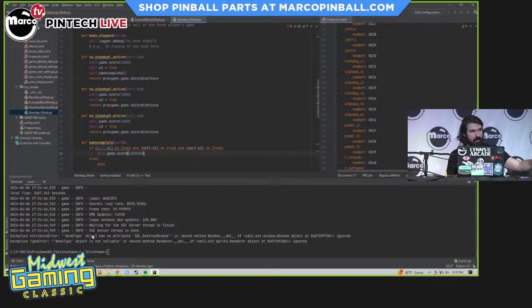One of the hard things about Skeleton Game is you have to do the work. With a framework like Mission Pinball Framework, you're writing config files and everything in the background is being handled. Whereas with Skeleton Game, you have to tell it, all right, this is the event I want, this is what I want it to score. I want it to play this sound. Okay, I need to also load that sound in somewhere. It has an asset handler to load that in. You don't have to worry about memory allocation stuff, but you still have to handle all of those things. Or, I want this animation to pop up. Well, you need to create that animation layer and tell it, is it visible? Does it have things behind it?